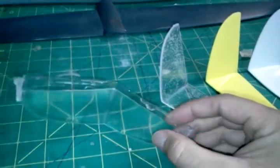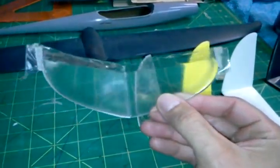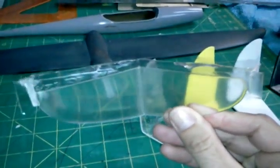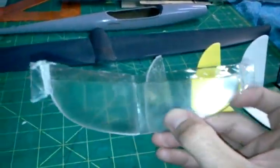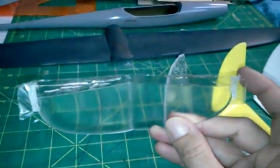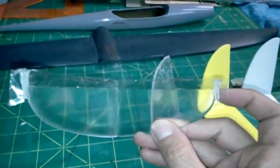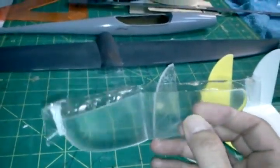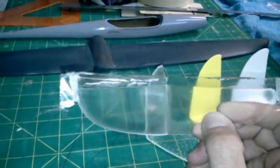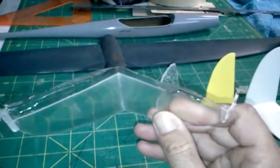This last piece is a really nice clear cast part — really high shine, very good clarity, no bubbles whatsoever. You can see the flashing is still on there just to illustrate how material goes in and comes out. Either side could be a fill port, and the other side directs the air out as the material flows through the mold.